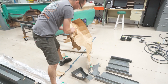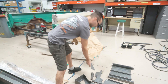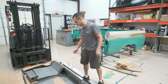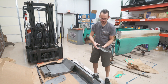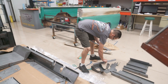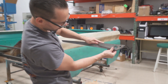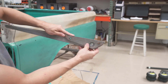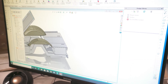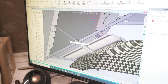These are weld-on pieces that I have to weld on after the fact. Depending on how you design stuff, sometimes you can't bend everything, so you have to weld some parts on. These are the hinge gussets. The arms bolt right to those and that's the pivot point — see how it lines up perfectly. This whole thing supports the main bed lid, it pivots like that, and then it all bolts right to the top here with threaded inserts.